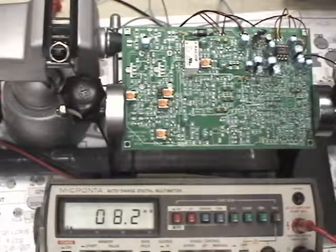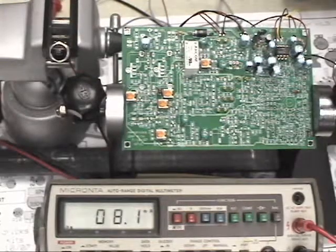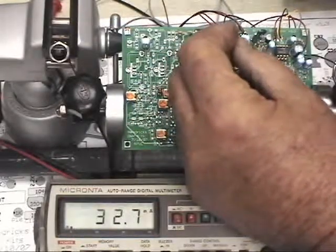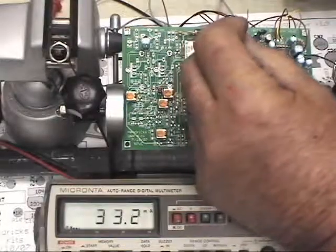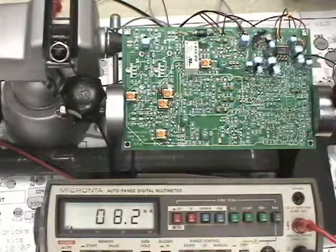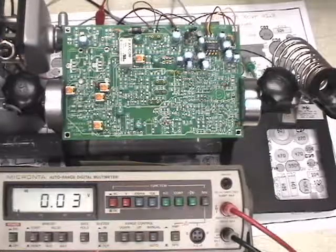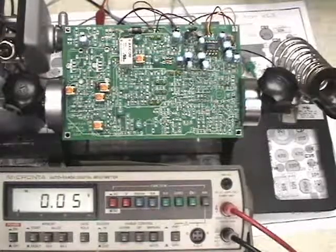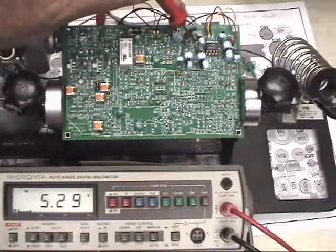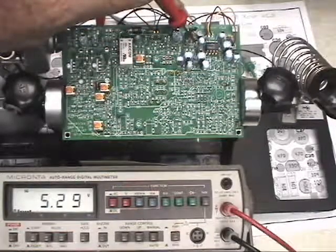The procedure calls to touch the leftmost pad of C47 with a piece of wire. C47 is down here and hasn't been installed yet, which makes it easy. I have a loud hum — that sounds like that piece is working properly. Reconfiguring to measure voltage, I want to measure the voltage across R88. I find R88 on the board and touch its top lead with the voltmeter — I have 5.3 volts, and I should have approximately 5 volts. We've passed that step.